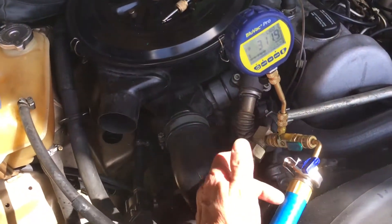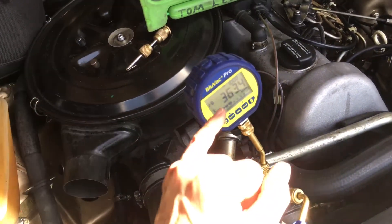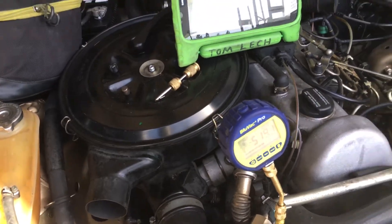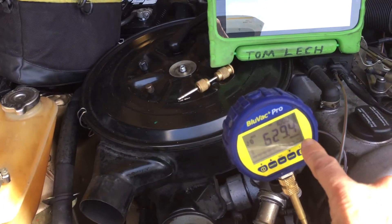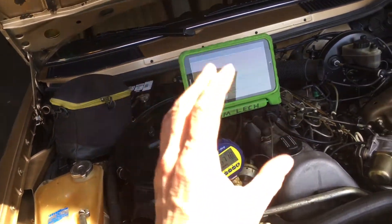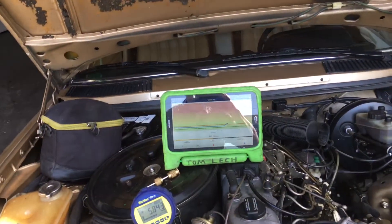Watch — I'm going to turn off this source of vacuum right now. And you can see it raise: even though I have vacuum on over here, it is still rising because there's a bit of moisture in this system. It'll keep rising and level out around 1,400 to 1,700 microns, then start slowing to the point where just the tens start clicking off really, really slowly — something you could never read with analog gauges. You can see where I closed off the vacuum and the reading started going above 500 microns.